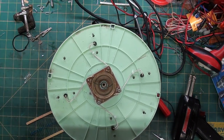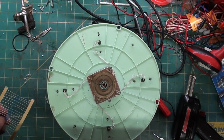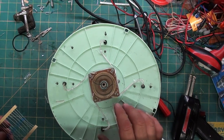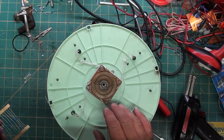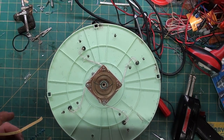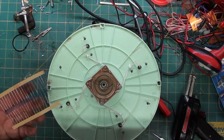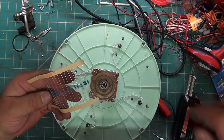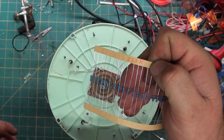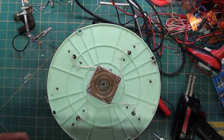Fingers all dirty from the grease. What we're going to do is, the resistance that's required to take the 7.7 volts that's coming in and drop the current across the lights is about 230 ohms. Well, there's already four 10 ohm resistors in there, so we're just going to add a 220 ohm in line. You can see it says 220R, 220 ohm resistor, to make it 230.